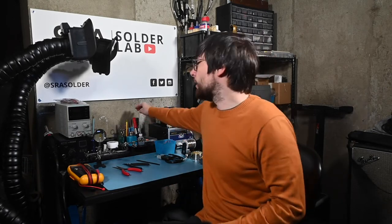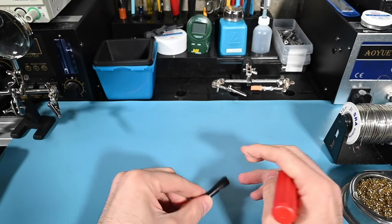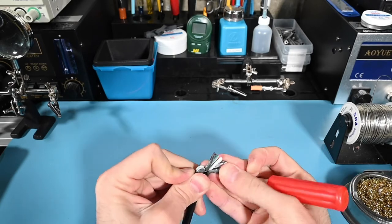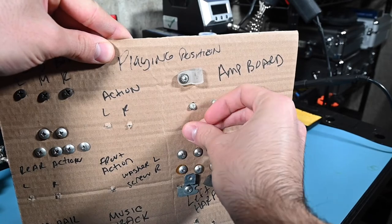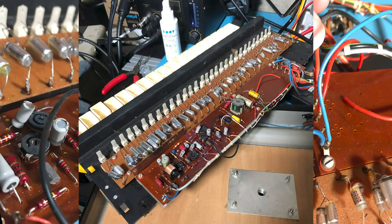The precision utility knife is really one of those indispensable tools that's great for a variety of purposes. I use mine a lot for removing old heat shrink tubing, tape, and other adhesive materials. And as with the wire strippers, they can benefit from a little dullness — this makes it easier to cut through the sheath only and not damage the wires inside. Now while this next one is not technically a tool, I believe having some good parts bins handy while soldering is an absolute must. Whether you're disassembling or assembling, you'll want to keep track of all the parts as you go, and it's good to have a variety of sizes. I'm also a big fan of using cardboard to hold screws and other hardware — I simply poke them through and make a note of where they go. It's always a great idea to take pictures on your phone or digital camera too as a backup to remind you how everything fits together later.